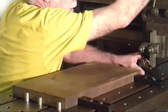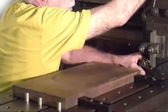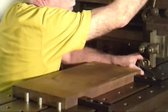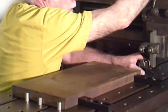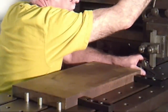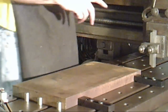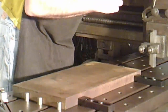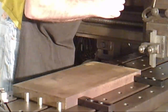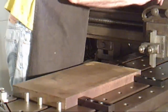I'll set this under the tool bit and lower it a little bit until I'm just starting to clear. I've just started to catch right there — back up, down right about there. I know from experience that four to six thousandths is about all the deeper I want to go. So I'm going to just turn it down: one, two, three, four. Lock the vertical off.